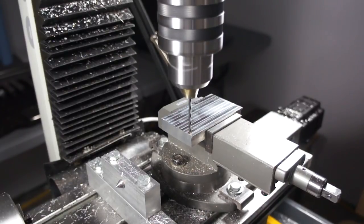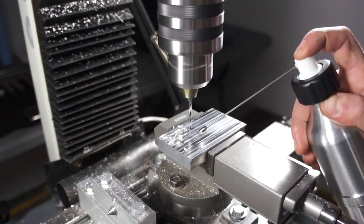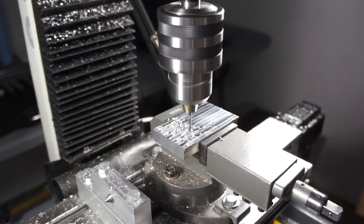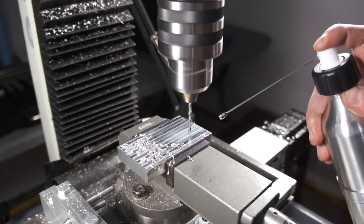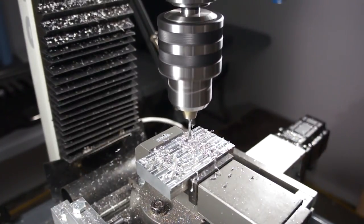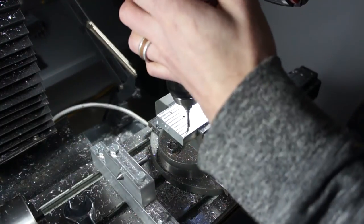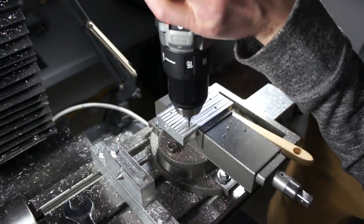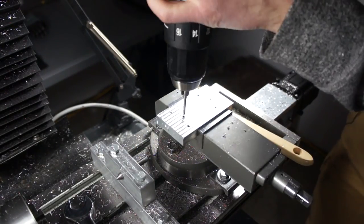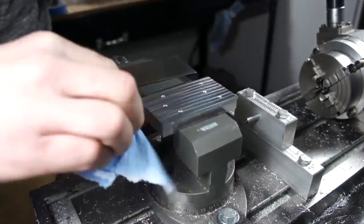Next I'll run the operation to drill all the fixture mounting holes and tap them to M3. I'm pecking them because I haven't done a lot of CNC with this mill yet, so I'm learning my way through it. I have the feed rates roughly where I want them but the rapids turned way down so I don't crash into the vise. Drilling cycles seem to work well and I'm going to hand tap all the M3 holes. I could use the mill to hold the tap straighter, but for this purpose exact alignment of the threaded holes wasn't critical so I did it by hand.